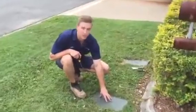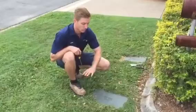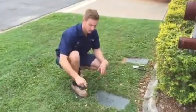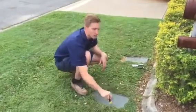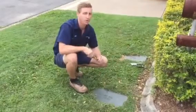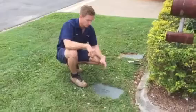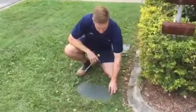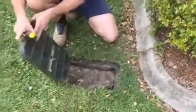The meter box is quite easy to see, but often there'll be a garden built over it, or grass will have been allowed to grow over it. In that circumstance, just get something sharp or a shovel and feel around. Just on the boundary line in front of the tap is the best place to start, as I said. To pop the lid, find the finger hole and use something to lever it up and open it.